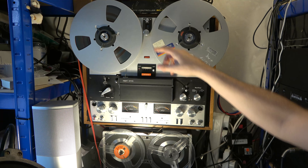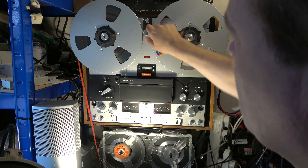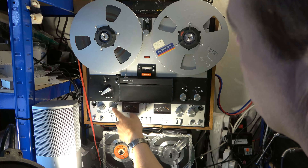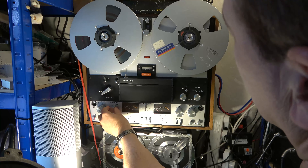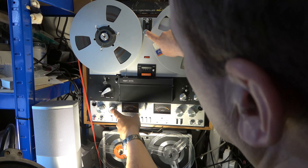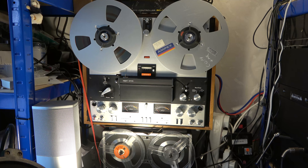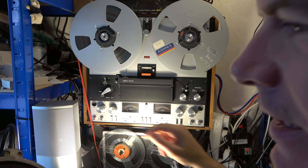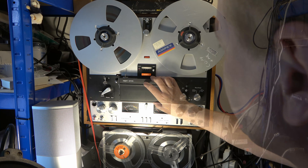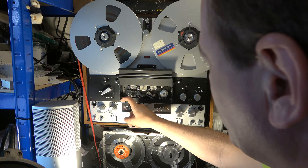Flick this switch over. These tapes are usually run at 7.5 or 15 inches per second. Here's a strange thing: you set 3.75 IPS with the low equalization setting, 7.5 with medium, and 15 with high. If you don't get that combination right, the machine will refuse to work and just lights the reset light. You'd ask why didn't they tie the speed and EQ settings together, and the answer is I really don't know — it seems like an oversight. To load the tape, push that down.